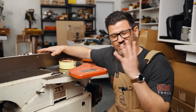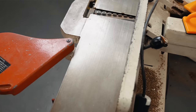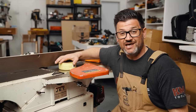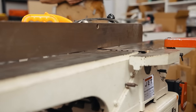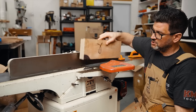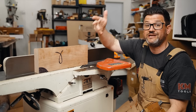There are four things in jointer safety that you should never compromise on. First is wax. Waxing a jointer is really important — you don't have to do it every time, but you should do it regularly. Your board should slide smoothly on the jointer's surface. The last thing you want is for it to be hard to push a board through a cut when you've got something spinning at 5,000 RPMs — it'll suck your hand right off. Second is the fence. Your fence should always be set so that no portion of the cutter head is exposed on the left side of the board. That would have saved me with my thumb — I would have still been close, but I wouldn't have hit the cutter because there would have been none exposed.